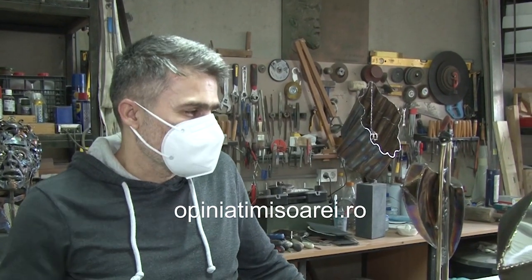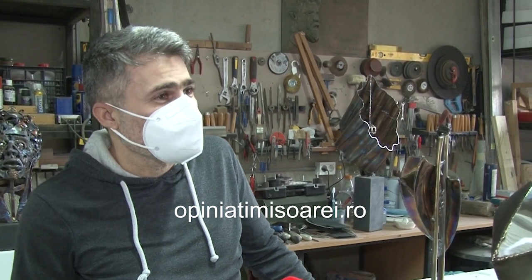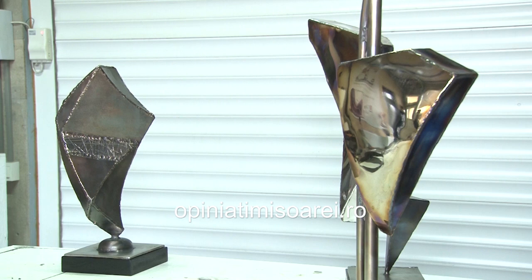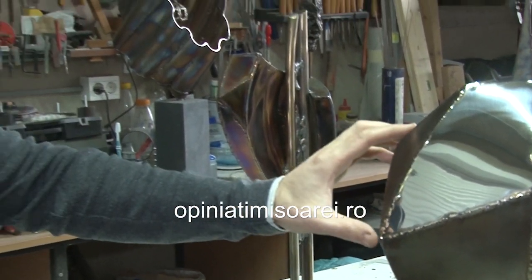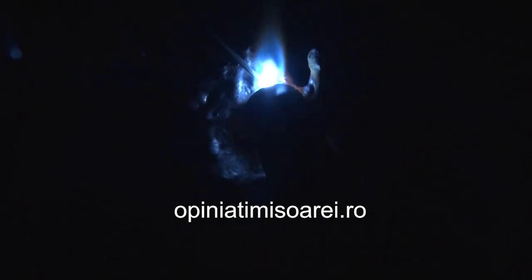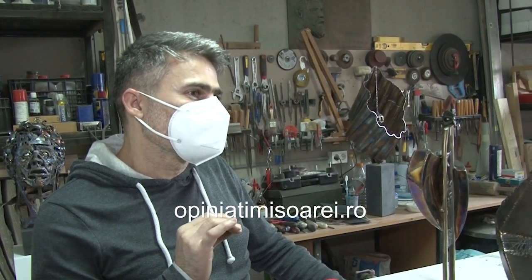This sculpture is also made with the help of welding and is a composition — or better said, a combination of two metals: bronze and stainless steel. As you can see, the bronze is patinated in a dark shade, while the stainless steel is left with a mirror polish, so that this chromatic quality stands out very well — even though we can speak of a muted chromatology of metals. This is not a weld I would recommend for industry; it is not a structural weld, but it is a fusion which, at least for plastic arts and sculpture, works well.